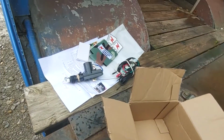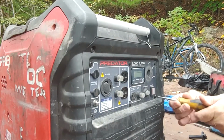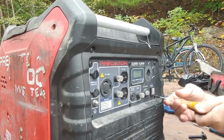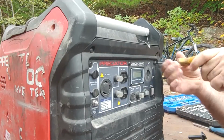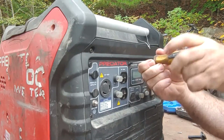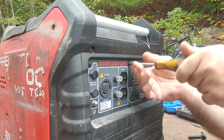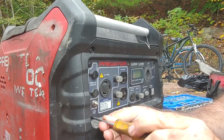I had anticipated two of them, because our inverter is only a 2,000 watt inverter. And in the morning, sometimes if we've got the heat or the AC going and the coffee maker going, the battery voltage drops a little bit, we get a little alarm, and it'll be much, much better to be able to fire off the generator, supplement the power while we're doing the high draw stuff. But let's see how this goes, right?